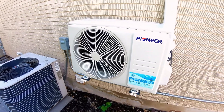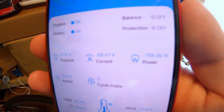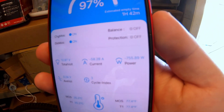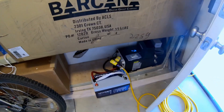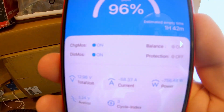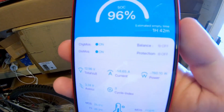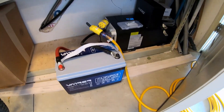Let's run back to within Bluetooth range and see what kind of power this is pulling. Back in the garage with the mini-split running, plus the overhead from the inverter — 755 to 757 watts right in there for the initial startup. Once it's run for a little while and the set point temperature gets closer to where it should be, I see it ramp as low as 200 watts even with the outdoor unit still running. This battery can easily run a 120-volt mini-split heat pump.